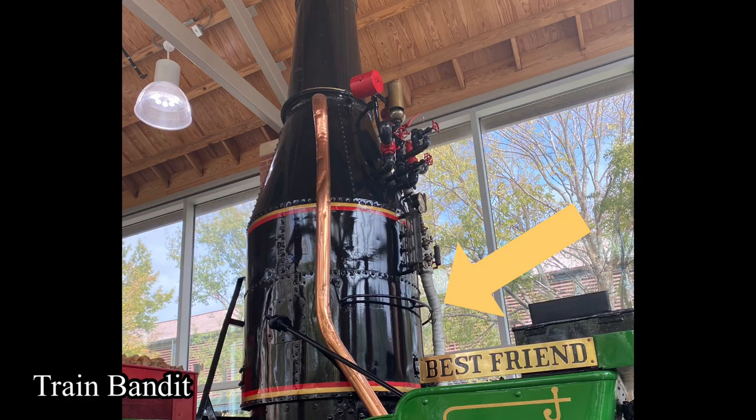Closest to the window, I will point it out, is a delivery line for the steam, which would go into the cylinders. We'll get to that later. That is coated in insulation, which is the white stuff that you see on the outside, which keeps the steam hotter, being more of a drier steam, which becomes a high-pressure steam. Being that it doesn't really run through much heat, it probably was not very high pressure. And then it goes into the cylinders.